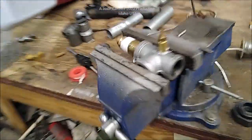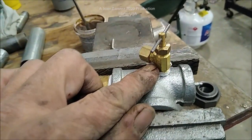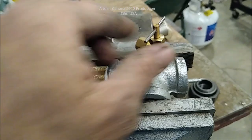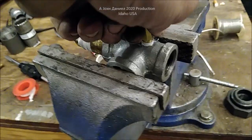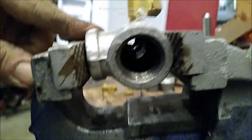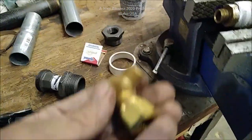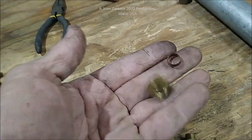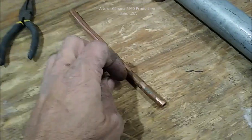This will be for my fueler, which uses a starter fluid combination, and this will be for the drip leg where it drips fuel in. You can look down in here — that fitting inside is just a compression fitting. It has a nut and ferrule — standard 3/8 compression — to use 3/8 copper for my oil drip line.